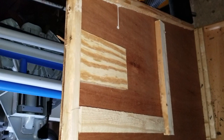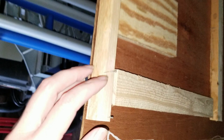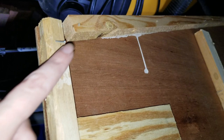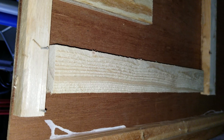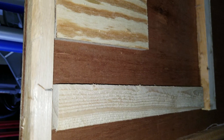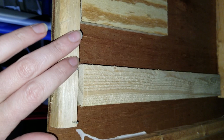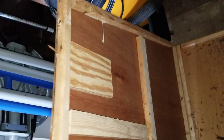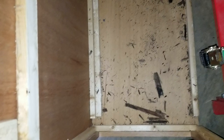It is kind of difficult, but we were able to get it done without destroying or damaging those panels. You can see right here how they're tacked on with these little finish nails all the way around. They're not glued — those little finish nails will probably pop right out of the paneling. When you put the paneling back on, take these finish nails off and reaffix it with new finish nails, then putty over the holes that were left before. That's how you get to the screws.